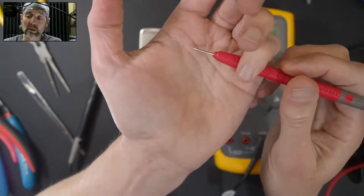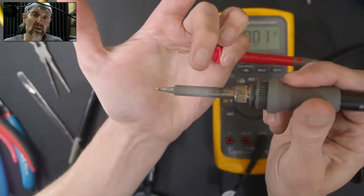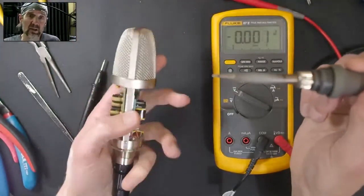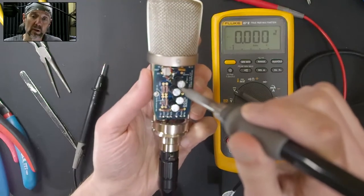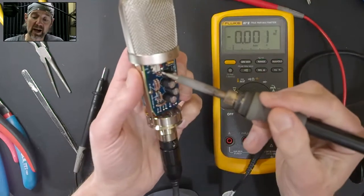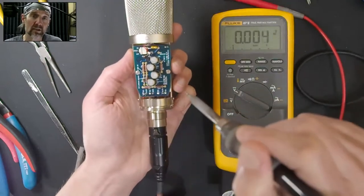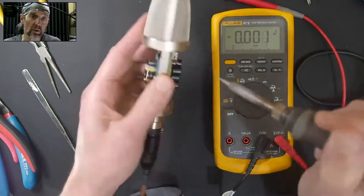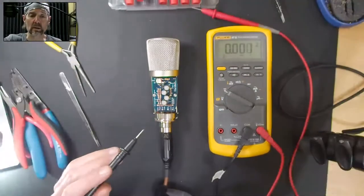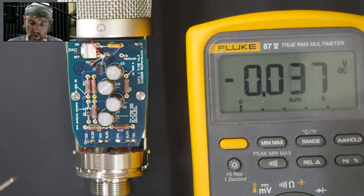You have to be very careful of where the shaft is, not just the tip that you're touching to something. It's similar to with the soldering iron — when you're soldering with the tip of the iron, you need to be careful because the part back here is hot too. If you brush that up against a capacitor or something, you're going to cause problems. I've seen when people are soldering the input joint of a mic, the mic will show a burn mark where the shaft ran into a nearby capacitor, which is why it's always a bad idea to solder from the top side of the board.